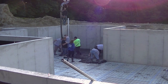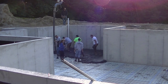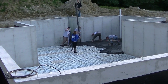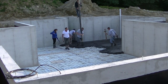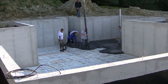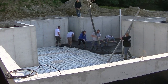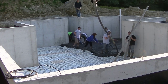I've got a pretty big crew here today with some extra help. We'll pour the garage also, and that'll be in a different video. We'll pour this whole truck out before we really start on the next one. This is about a 2,000 square foot basement floor — it's a good size house. It's also got radiant heat tubing in there, so they're going to heat this floor. It's got two inches of styrofoam under it. That's pretty common for a lot of the floors we do in Maine. This floor is a four-inch-thick floor — that's pretty normal.